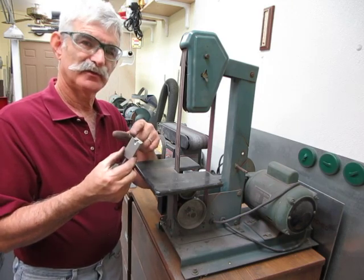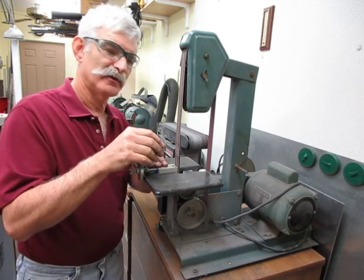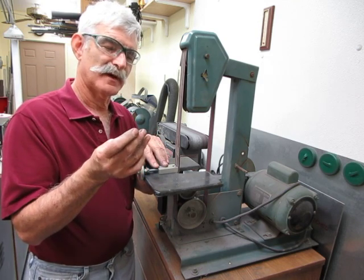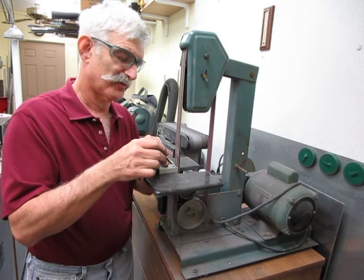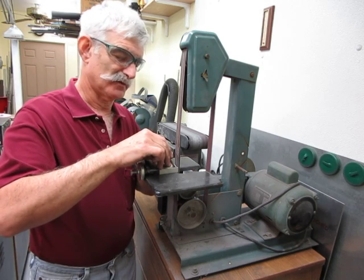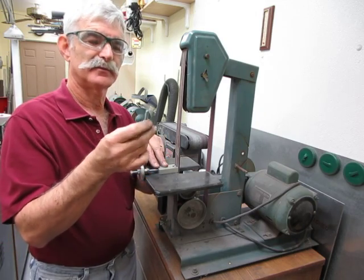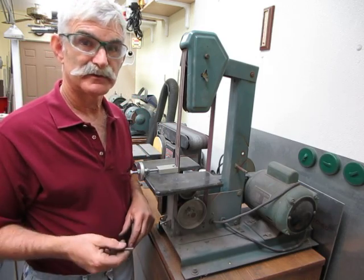This face of the cone is vertical, so as you put in the bolt the diameter of the bolt sets the depth — the amount of thread that's going to be removed — because the larger the bolt the more thread there is. You just put it in, hold it roughly at the center of the cone, give it one full turn, and out comes a beveled bolt. That's all there is to it.